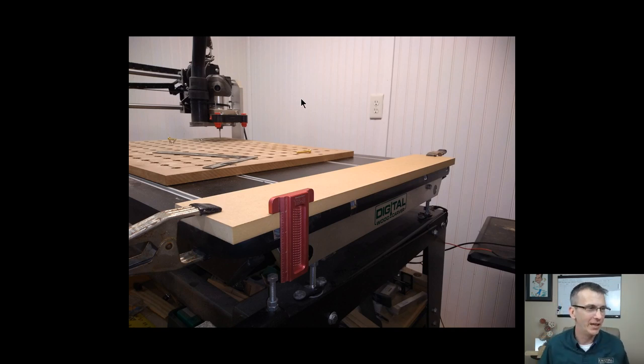Okie dokie. So basically, these slats, the individual slats, for me on my table, are going to be running across, and that's my y-axis. The short side of my table is the y-axis. The length of the table is the x. My actual tabletop is 30 inches wide. So I ripped down from a piece of 3/4 inch MDF, 30-inch long pieces that were 4 3/4 inches wide.